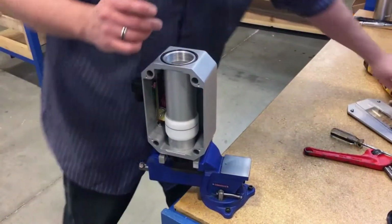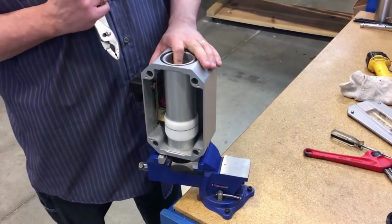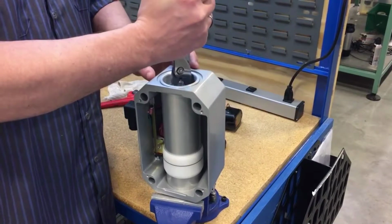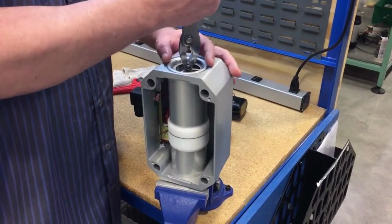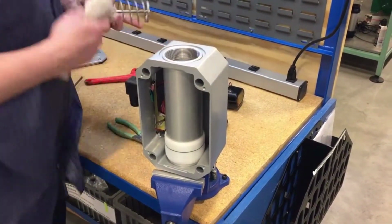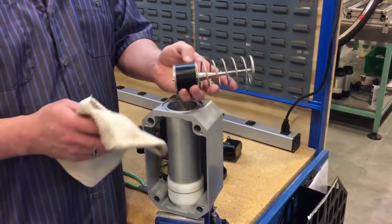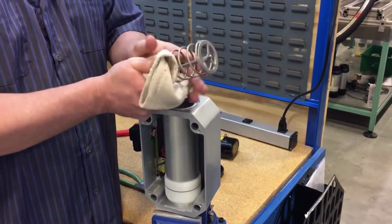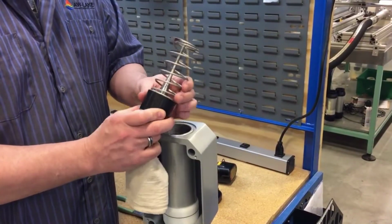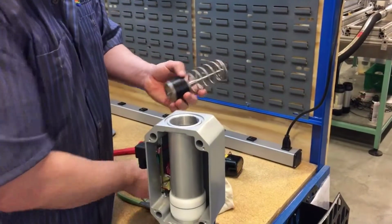Now, take a pliers to help remove the cartridge for inspection of the meter. Make sure you do not damage the internal cartridge. By using a rag, you can wipe down the cartridge, making sure there is no debris or other magnetic particles on the magnet, or any cracks.